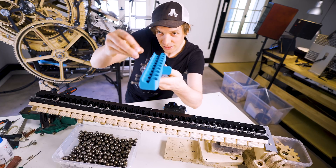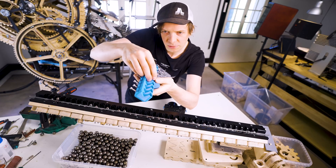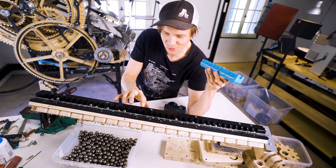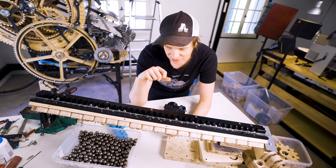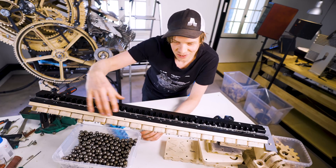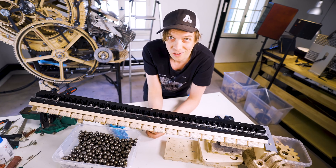What I noticed in the last test is that when this was tilted forwards, gravity is pulling the marbles into the pocket with less force, which actually makes it less smooth. I don't want to do 10 degrees — 20 or 15 was perfect. So 15 degrees is the winner; that's what I'll use for the Marble Machine X. I want to show you how I machined this top PUM part and how I integrated it with the plywood divider to make this work.